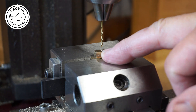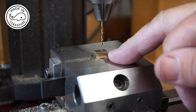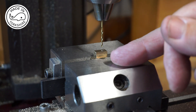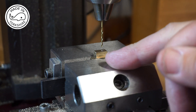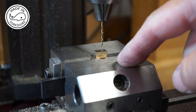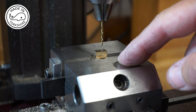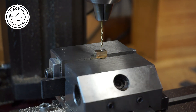I've marked the position for one of the side holes. I'm initially going to drill with a 1.5mm drill bit, then switch it round and do the other side with a 1.5mm. Then I'll drill right through both holes with a 2.1mm drill bit — I still can't find the 2.3mm — and then I'll ream it.